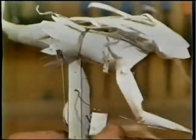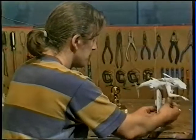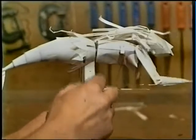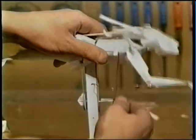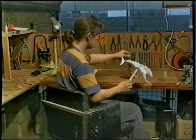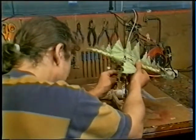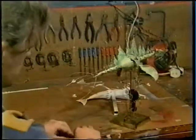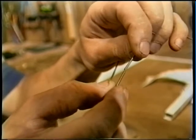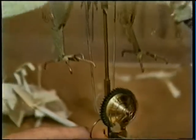This is a prototype I've made of a mermaid, made just from paper. I make them from paper first to make sure everything's going to work okay, and then I can use the paper as a pattern to cut the brass out. It's actually driven by an elastic band. Elastic bands are quite good because there's a lot of friction, but they're quite bad because there's a lot of stretch — so if they're put under any sort of tension, they'll just stop and slip round the pulley. The mechanics on this dragon are the same as the mermaid. The drive belt used is the commercially available type used for model steam engines. Like the elastic band, they're springy and stretchy, so you get plenty of friction. Unlike the elastic band, they're a lot stronger and they don't stretch quite as much. There's enough friction to drive all the parts in this dragon.